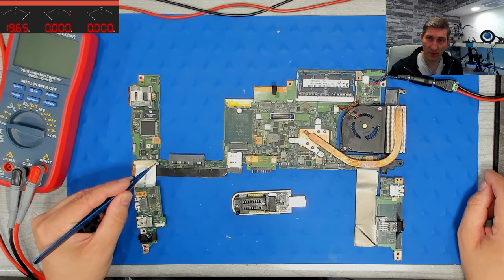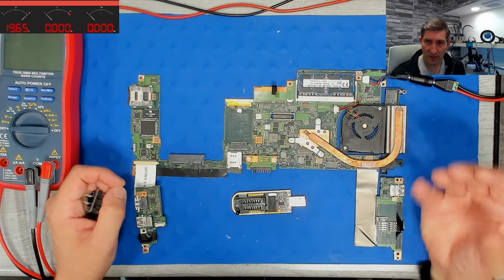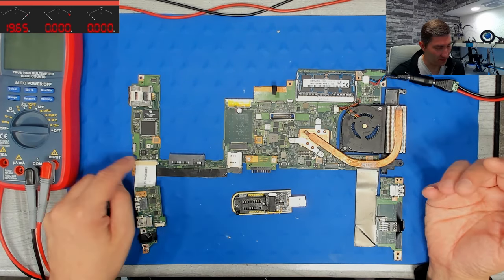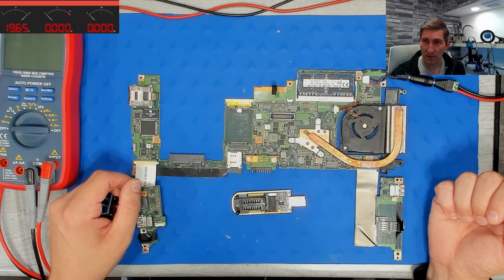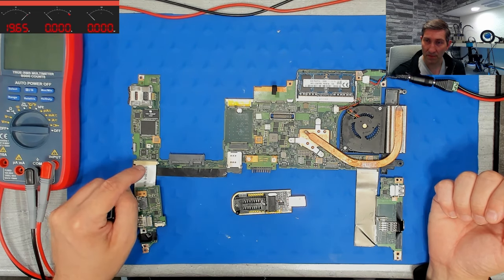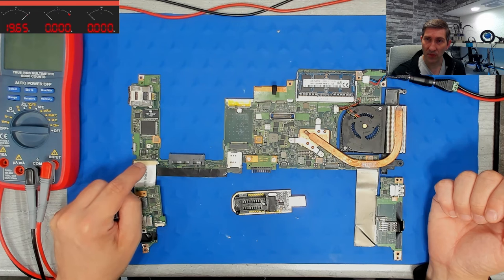Do you understand what's the point? The programming software doesn't get the interferences which will be created through the clamp and through the circuit. And it will appear as everything is fine, but it is not. And you won't realize that you are reading a corrupt dump. This is why you should never use the clamp if you don't exactly know how you can minimize the risk of corruption.